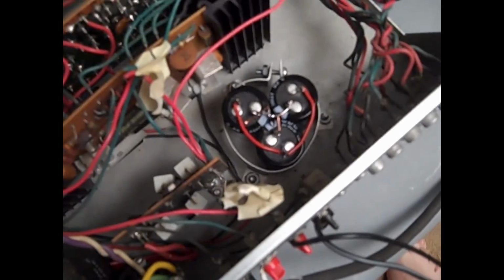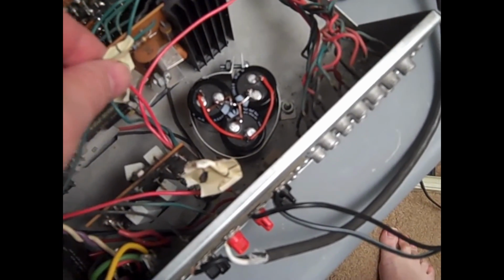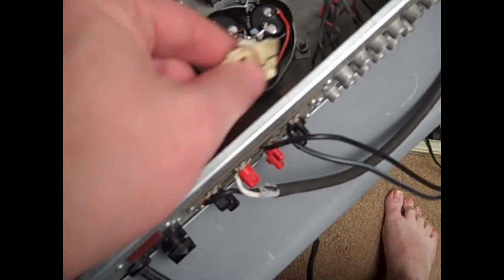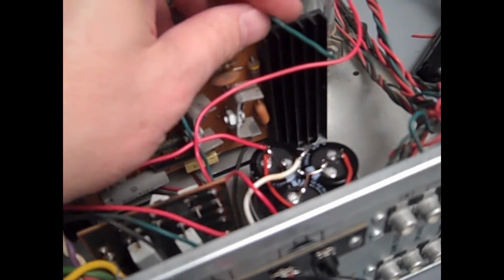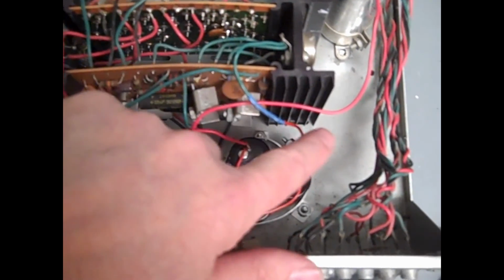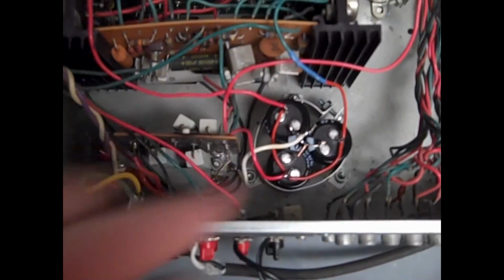Turning the amp up on its side is about the best way to get those screws back in. It takes a little bit of patience. All that remains to do now is to solder in the wires that we had previously removed, and then we're done. If your amp's like mine, there's a good chance that the green power wire will be too short. Installation's complete. You'll notice we used a little bit of blue heat shrink to splice the green wire with some of the supplied red wire so that we had enough length to get over here to the capacitor.